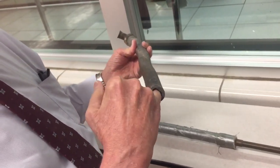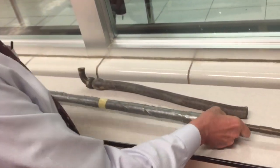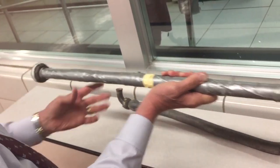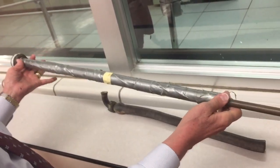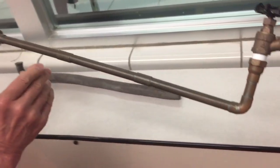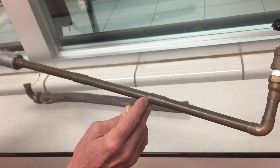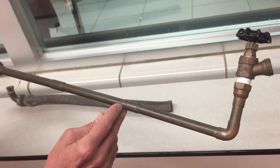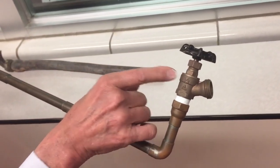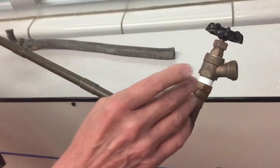Inside here you would have lead metal. I'm going to put this down to give you a little bit more of a mock-up. Here is a representation of the water main on the street. If you have a lead service line, then you have copper piping in your house, most likely. There are joints along the way in the copper — those are filled with solder. If it's an older house, that could be lead solder. Then you have a fixture, and that fixture of brass or bronze does contain some amount of lead, maybe 3%, 4%, 5% lead.